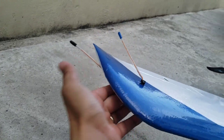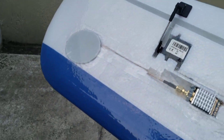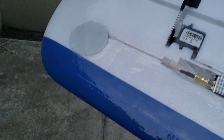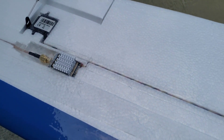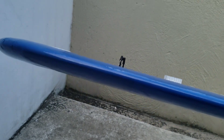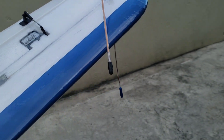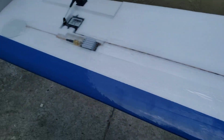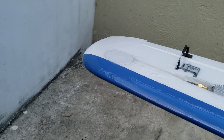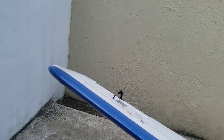On the other wing I have the Matek 1.3 GHz video transmitter with a Singularity circular polarized antenna — this one is RHCP, right-hand circular polarized. I've got the wires running from the VTX to the wing root, and added a heat sink to provide cooling. The antenna is flushed into the wing so it doesn't add drag. The Dragonlink antenna is 433 MHz, so it's quite long; I opted for an RHCP side-feed type into the wing to reduce drag.